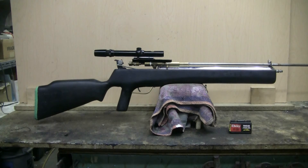It has an internal bore that measures about 270, so that's a little slack for 25 caliber BBs, and I might try to find a better barrel sometime. The valve is a piston valve, piloted by a hammer valve. I made up from flat steel a hammer and trigger mechanism. This is a single shot bolt action.